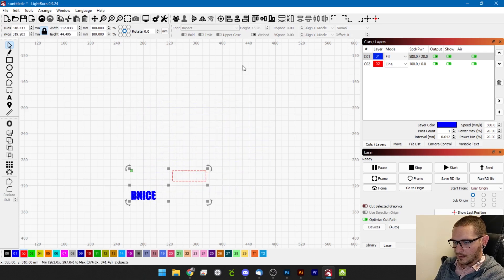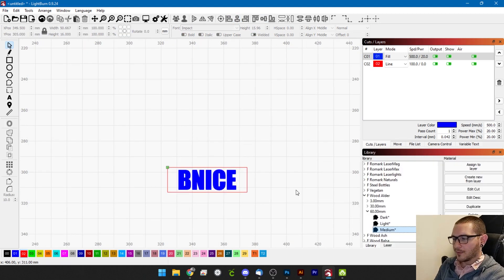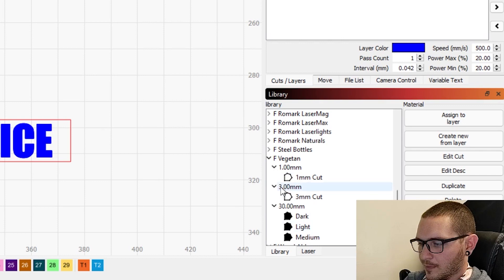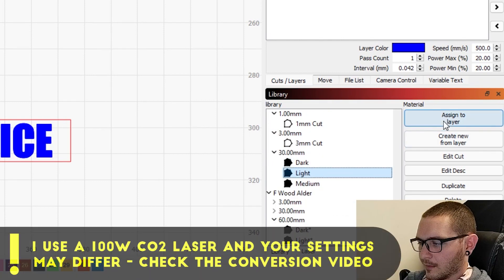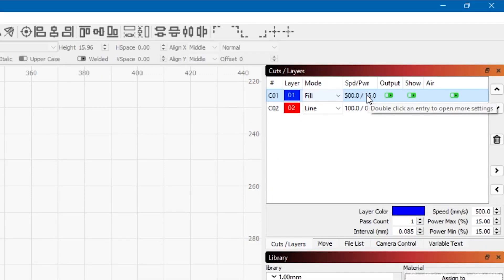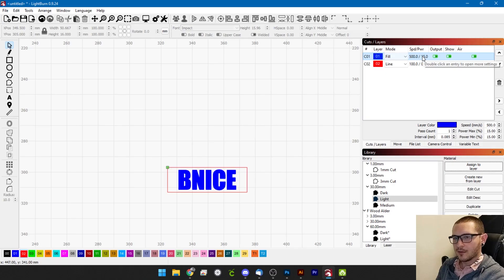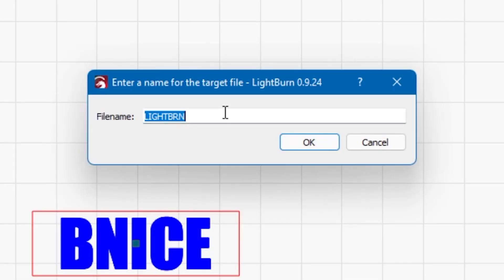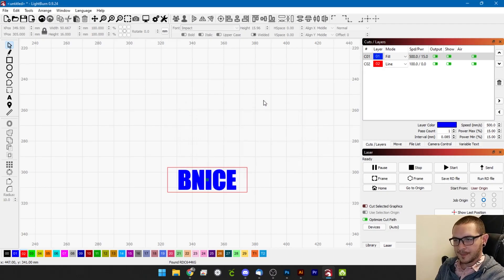We'll take this down and get it centered up. Before we jump over to the CO2 laser, we need to pick a setting. For this I'm just going to use my normal veg-tan leather setting — we want the light setting and we can add multiple passes if we need to. We'll assign that to the layer. This is a low power setting; we can start low and always add more. We'll make sure to set our job origin to center, name this 'basketball,' hit OK, and that'll send it over.